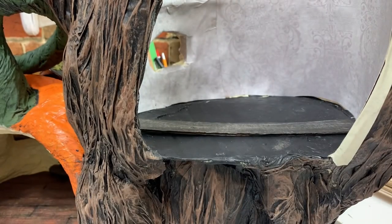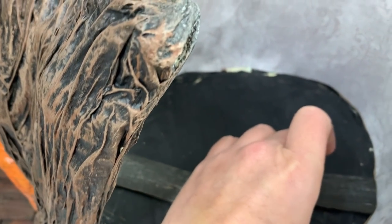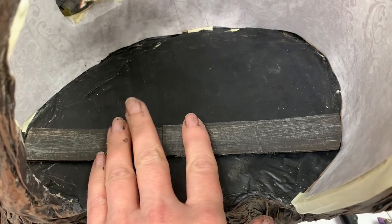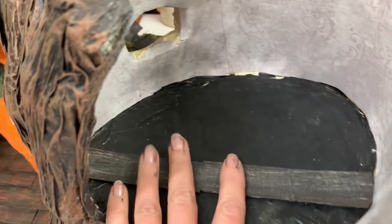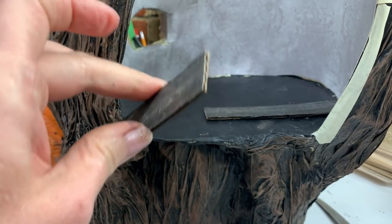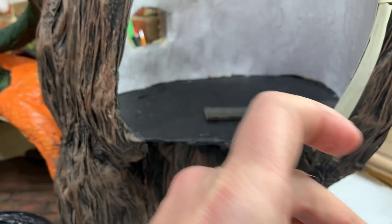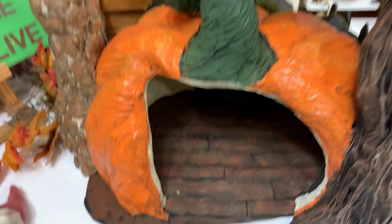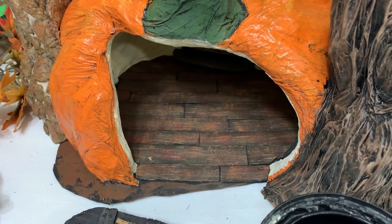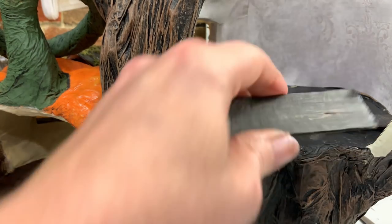I've tapered the end here so it fits right up against the wall; the other end is cut a little too short but that's okay since a door is going over there anyway, so I'll start down here. An optional step: wherever I've cut the boards I put in some black paint on those ends - you can see on this floor how I've darkened up every end, which adds age to the floor. It's not totally necessary but it's a nice touch.